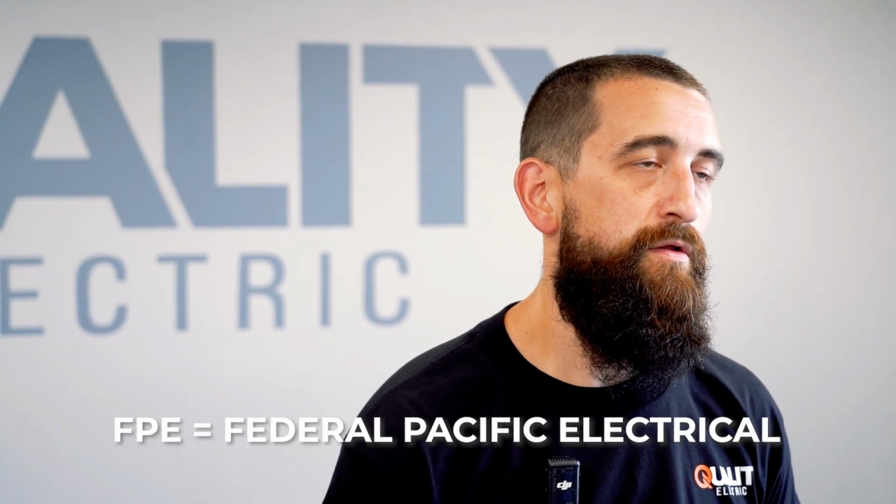One thing we get a lot of time is, hey, I just bought a new house. How do I make sure it's safe for myself and my family? Well, my answer to that is that there's a couple things that we look for when we're evaluating the safety. Do you have an FPE panel? Do you have knob and tube wiring? Do you have ungrounded wiring? Are there smoke detectors? Do you have GFCI or AFCI protection? Those are kind of the key things that can help you determine if your electrical system is safe or not.